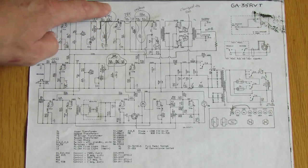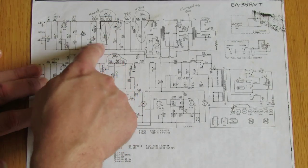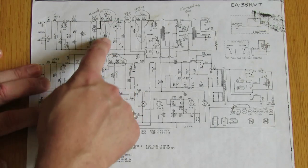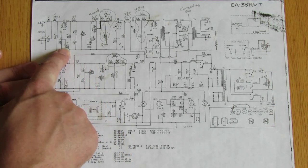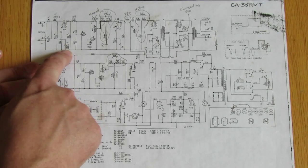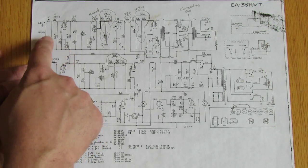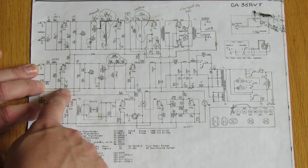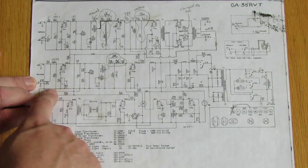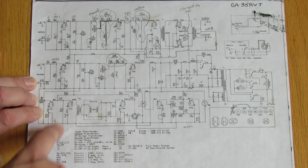This first tone network, rather, has been removed. I've taken all of this out. I've added a 33 microfarad bypass cap here, whereas I think before it was only like a 2 microfarad or something like that. That's beefed up the output from this first stage considerably. I've done the same thing down here. I've added a 25 on the second channel, whereas there it was again something really small. I've written over it, but I think it was a 2 microfarad, something like that.